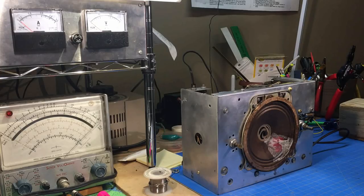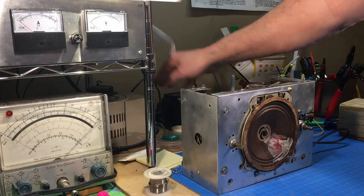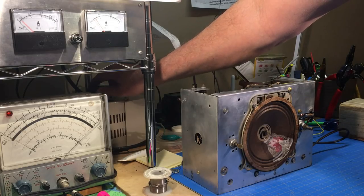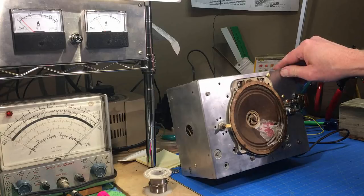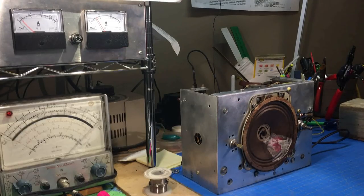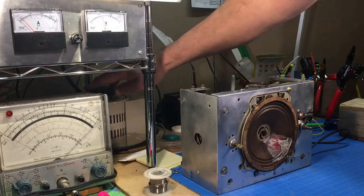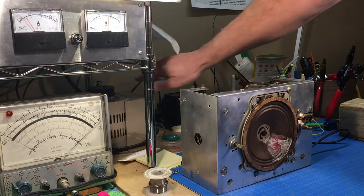Hopefully you can see the meter. I've arranged it where you can see it. We're going to make sure the variac's down through the isolation transformer and we'll bring it up in increments. Here we are at about 25 volts - looking at about 200 milliamps, not bad. The light is illuminated slightly. We'll let that settle a minute or so since these are new capacitors. Let's go up to about 90 volts. We may start hearing some sound - current's looking pretty good, still less than 300 milliamps at 90 volts.